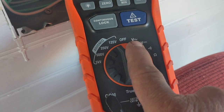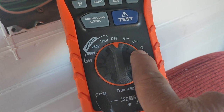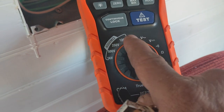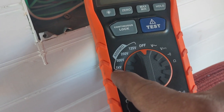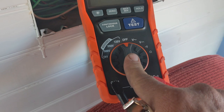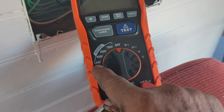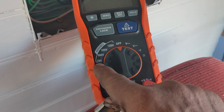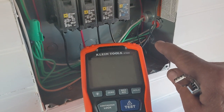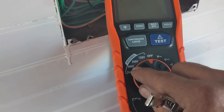That little wavy symbol — the sine wave — is for measuring AC voltage. That's for measuring DC voltage. This is for continuity — a little tone that tells you if wires are touching. And that is an ohmmeter for measuring resistance in a wire. Over on this side is where the magic happens. This meter actually will inject voltage into wires, so it could be potentially dangerous — it'll certainly zap you if you're touching it, because it can put out a 500 or even 1,000 volt charge voltage into wires. This is a 120-volt line and you want to test at two or three times that multiple, so I will put this on 250 volts first and then we'll try it at 500 volts.